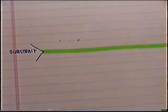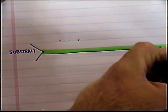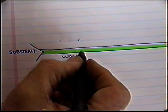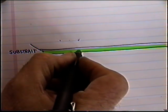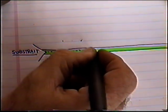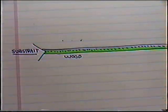No matter how you finish or with what material, you're going to develop a layer of material. This is going to be your wood. This in-between piece is going to be called the substrate. The substrate can amount to be, for most applications, clear dope, filler coat, tissue, combinations of dope, filler, talc, sanded, any combination, primers. But you're going to wind up with this base, and in the world of finishing, that's called the substrate.